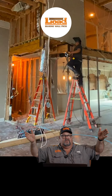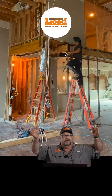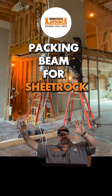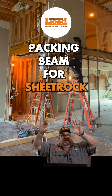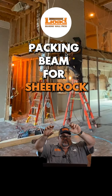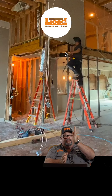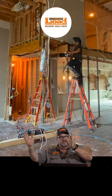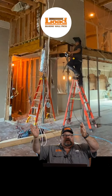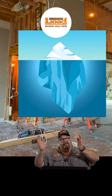Let's back up and use the word cantilevering. Think of a seesaw as a good example of a cantilever. On the cantilever, we're extending part of the beam out and having it over no support. The way we support it is we put a very heavy-duty support at the point where we stop supporting the cantilevered portion, and then we have to go back two times the length of the cantilevered part.